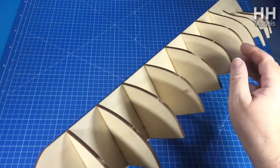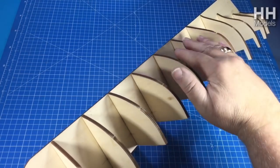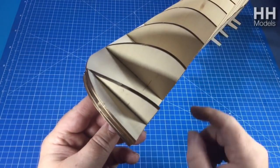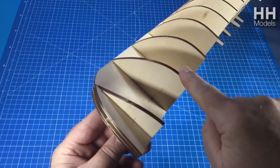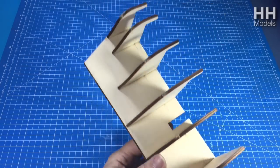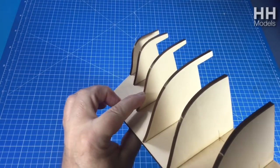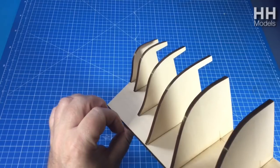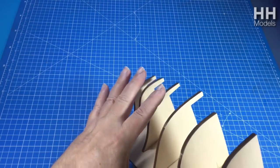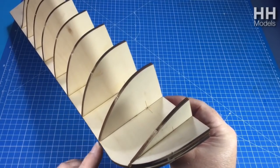It's worth noting that the middle three or four formers will be pretty well identical — very close — so you'll have exactly the same number of planks spaced exactly the same way. As you come to the bow, it'll basically take more of a teardrop shape. At the stern you get a different shape altogether — it comes down and then scallops out. So you get a complex lot of curves: it starts like that, then curves up, over, and across. Down at the bottom, you'll usually just get a curve down to your false keel.